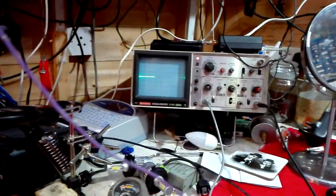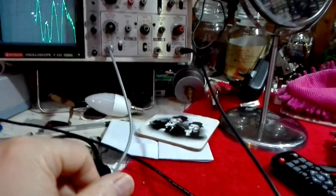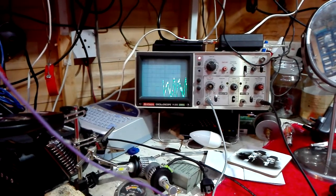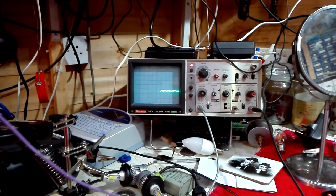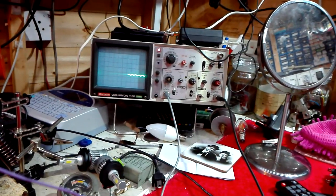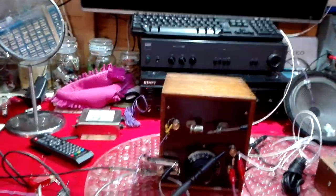We did have a wee look at the scope. That's West Sound — that's on 0.5 millivolts per division. Notice the DC offset when you tune it. There's another station. So they are quite low. Certainly if you don't use a very small value of coupling capacitor the volume comes up but the selectivity gets worse.